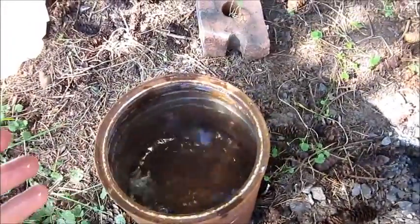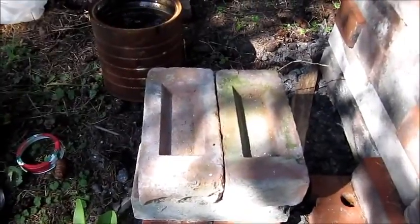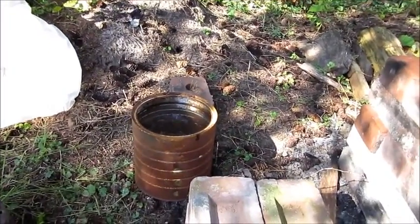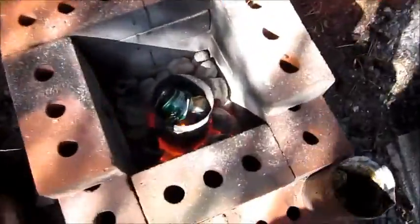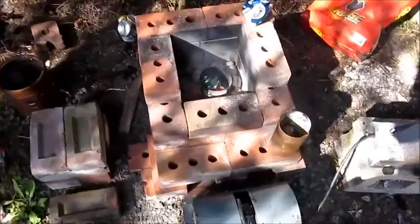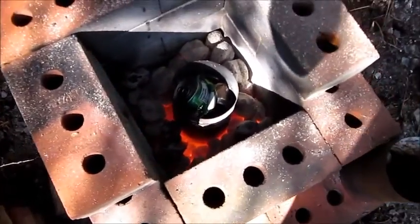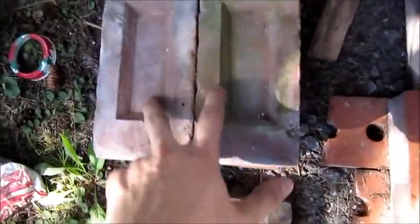I have the bricks ready along with a little pot of water to put the ingots in after they're done. You could just leave the ingots to cool in their bricks, but I like the effect of having the water boil instantly when you put the hot ingot in. I've gone through about half a bag of charcoal and had to go get another bag of cans. The crucible is probably about one third full, and we're going to try to fill at least these two ingots.